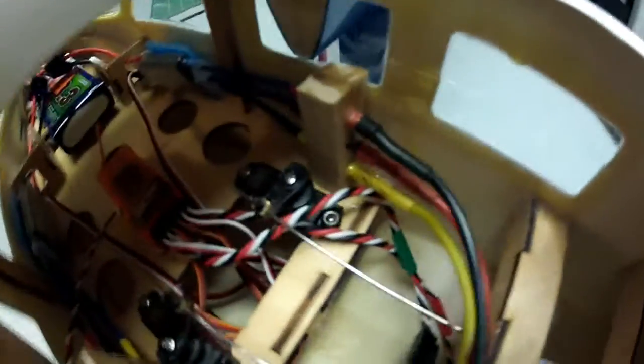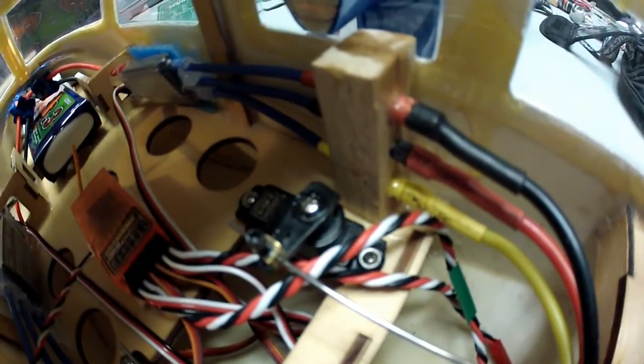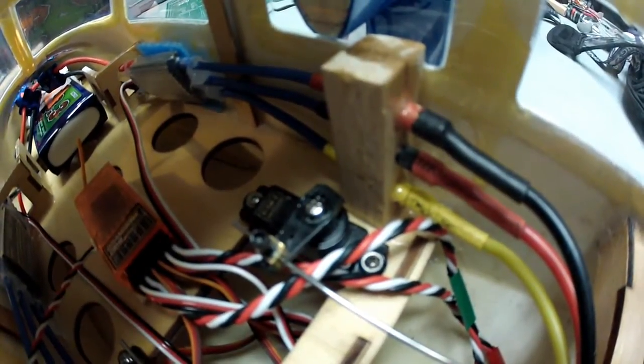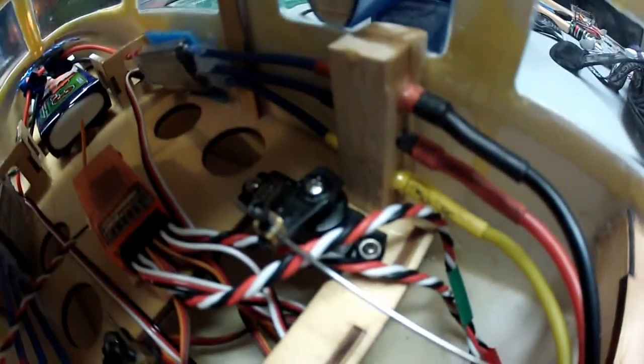You may notice the color is incorrect there — I got a slight error but I had to switch the wires to get the rotation right. I just happen to know now that the yellow wire goes on the bottom and the black and red are exchanged.